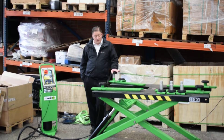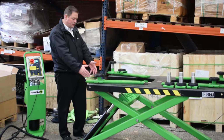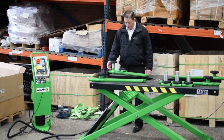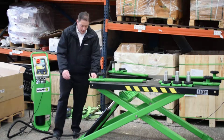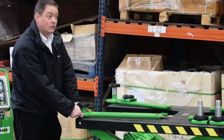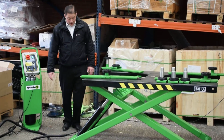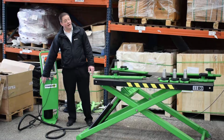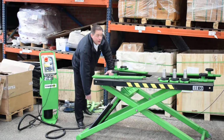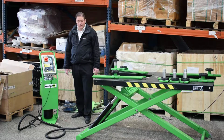Now, some of the issues that people have had with these lifts are mostly relating to the setup. It's a very simple thing to put together. It comes largely assembled, so you get this main base already assembled, everything else is attached. All you have to bolt on is these arms using one bolt, which is a long bolt that goes through here. Tighten that up. You then slide on your feet, and then in the end of the arm, there's a couple of grub screws. Slide them off. If you want them in a fixed position, you do have an Allen key grub screw there that you can use to tighten up and stop them moving. So you slide them on, and then all you have to do is connect up your hose, which is already attached to this end. You just have to attach it to the tank, or the power pack, along with wiring up the electric solenoid, which is just down here, and that plug and socket are provided in the kit when you get it. And then you're pretty much ready to go. It's as simple as that.